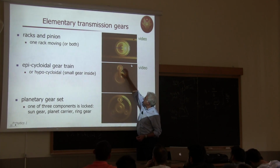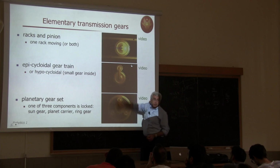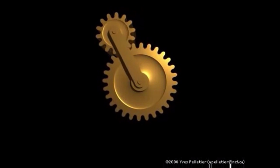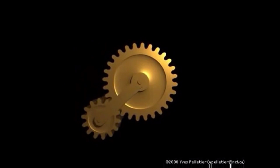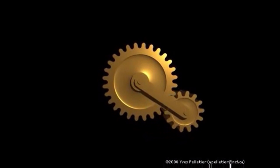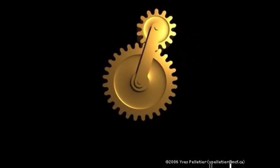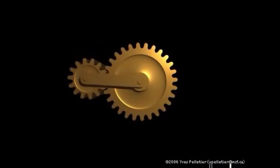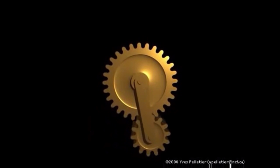There's also a hypocycloidal where the small wheel is rotating inside the large wheel. Of course, the teeth are looking inside in that case. So I've chosen just one of these. And now you can see that the speed of rotation of this wheel is much lower than the speed of rotation of this external wheel, just because of the difference of radius or of number of teeth. Okay? And so this realizes, if you take one input axis and the other output axis, a scaling of angular velocity. And since the angular velocity is being reduced, this means that the torque on the output axis will be amplified by the same factor. Okay?